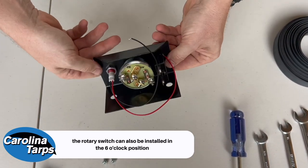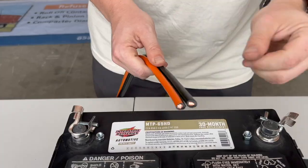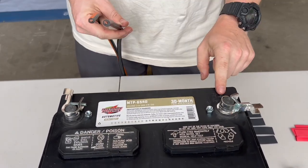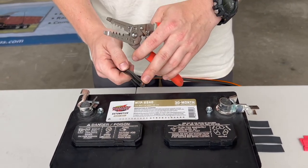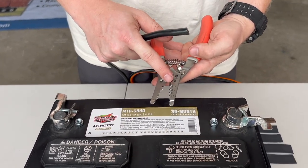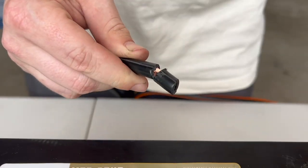Once we get our wire up to the battery box, we're going to disconnect the center braid — clipping right in the middle to start the separation process so we can grab it and give ourselves the freedom we need. All black is negative, multicolored is positive. This is a 6 gauge wire that is insulated and shielded. We have our 6 gauge stripper, but be careful — you might pull too much and start cutting the wire, and we don't want that.